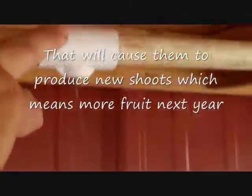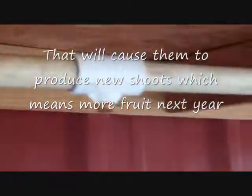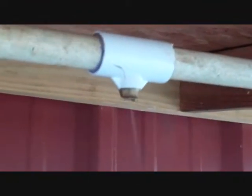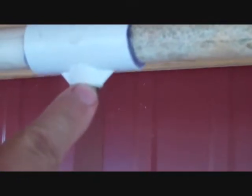I was waiting on my misters to arrive. I got these from Drip Works, I believe that was the name of it. You buy the half-inch saddle — it glues on — and I believe the mister fitting is a one-eighth or quarter inch. The misters screw in there; I put a little Teflon tape on them before screwing them in, though I probably didn't need the Teflon tape.